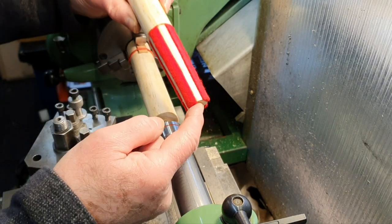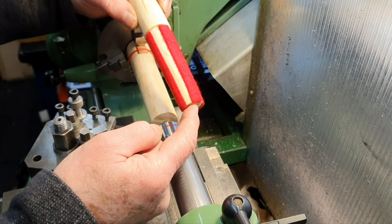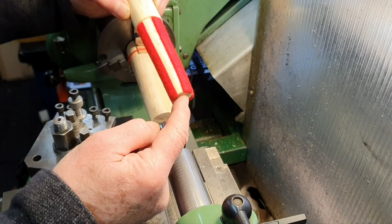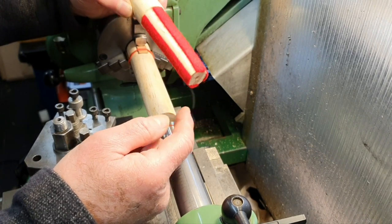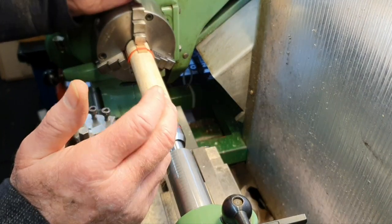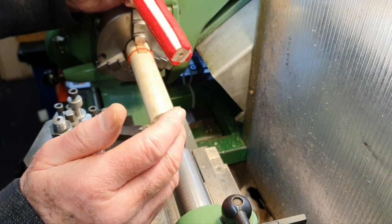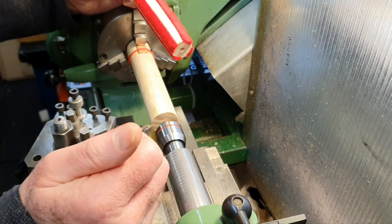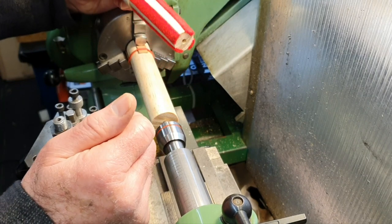Now this is for a Morse taper 3, so I can use this on the spindle on my milling machine and on my Chinese mini lathe. The headstock on that is Morse taper 3 as well. I'm making a Morse taper 2 version for the big lathe, where the tailstock wheel and the headstock taper are both Morse taper 2. The Chinese mini lathe's tailstock is also the same, so I need 2 of these.